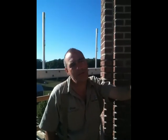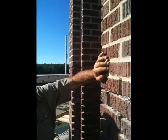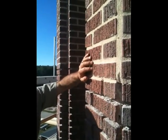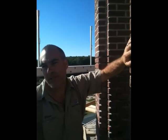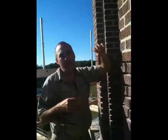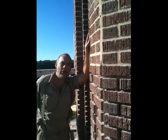Because the joints are whiter from being ground, I expect they may appear to be lighter in color, but I don't know yet because the scaffolding is still here. We're also careful to match the aggregate size of the sand to the original building, not to what was there previously. So as the building is repointed in other spots, it'll all tie together — we're trying to match the mortar back to the original on the lower part of the building.